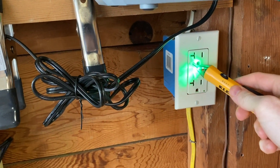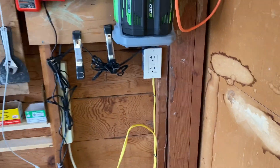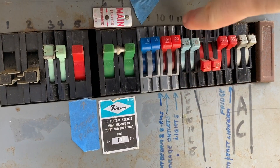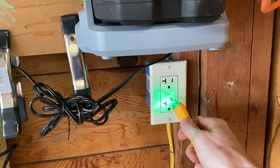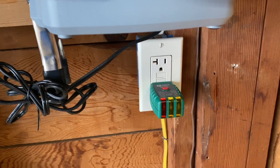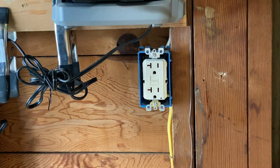The outlet is in, wired — hopefully wired correctly — that cover can go on in a minute. The outlet box is right there, the wire running through and down. The wire runs right there through this hole, over to the side and up. Now what we've got to do is open this panel up and tie this into here for the power.